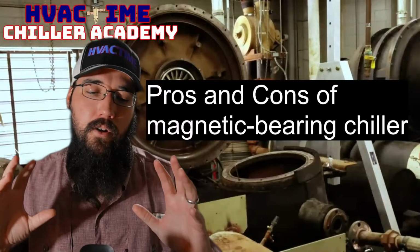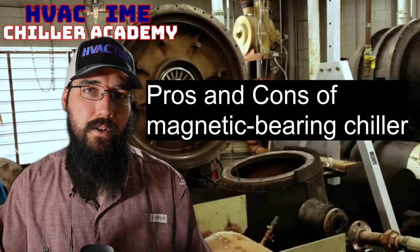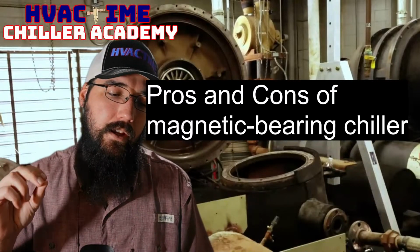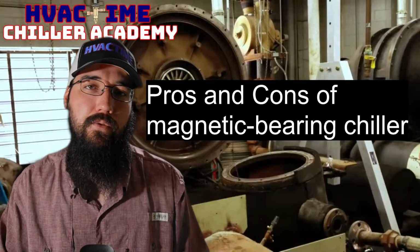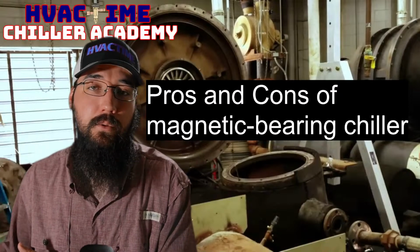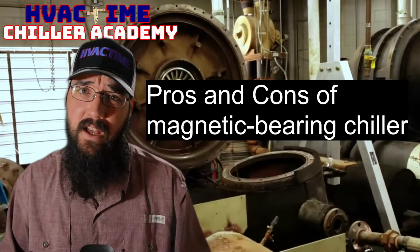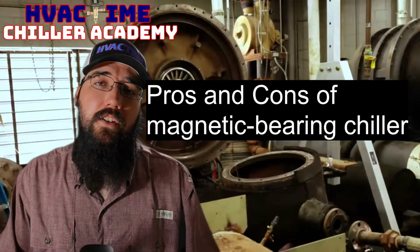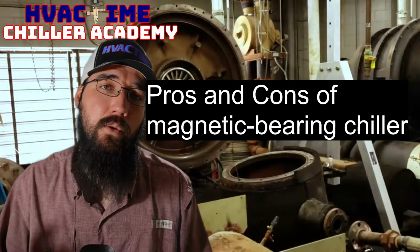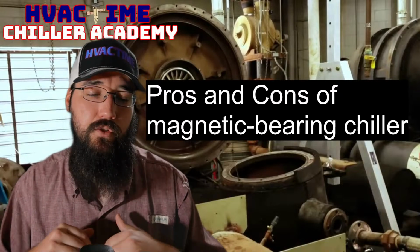So people are either retrofitting these into a system and they don't properly clean all the oil out, which is not an easy thing to do to begin with, or they end up charging dirty refrigerant, where maybe the cylinder got used on an oiled machine in the past and there was still some oil or oil residue in the bottom of it. And this happens all the freaking time. They turn around and charge that drum. It may be the same refrigerant that came out of there the first time, but now it's laced with oil, and then that oil gets into the bearing coils and just fries them.